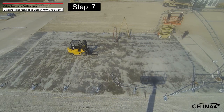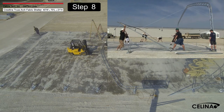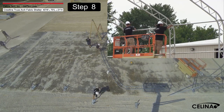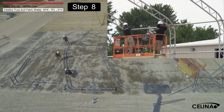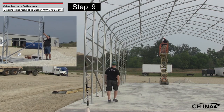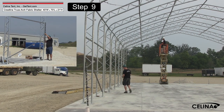Lay the remaining arches on the ground and install the other arch assemblies in the same manner. Overlap pinched ends of the roof purlins onto the same carriage bolts inside the frame assembly. Check the entire frame assembly so that it is square and plumb. Adjust the wind braces and roof purlins as necessary to bring the frame into plumb, then tighten the frame bolts adequately.